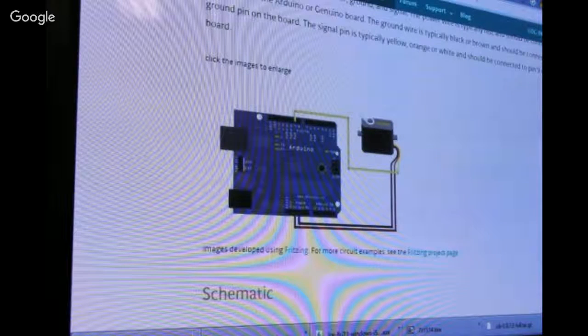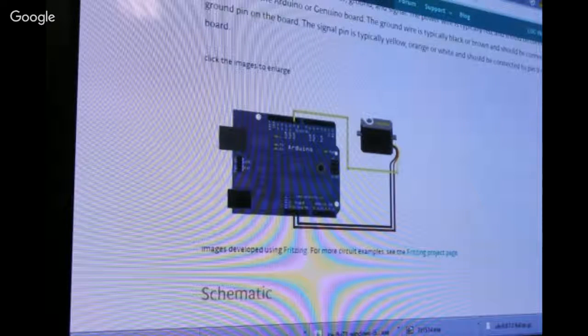Oh, this is a 4-wire. There is a smaller one. Sure, let's try a 2-wire. And this is actually a variant of a stepper motor. I guess we could talk about stepper circuits, but I'd rather not at the moment. If there's a larger 2-wire, that'd be good. 4-wire generally means stepper motor rather than servo motor, which you can wire up using the stepper library. That's where the H-bridge comes in really handy to drive that as compared to a transistor circuit, since you'd need to get power beyond your pins for both pins on that.